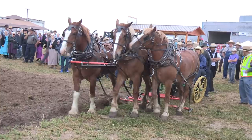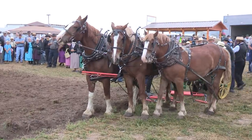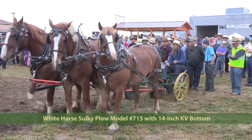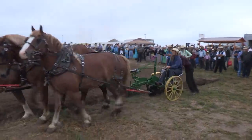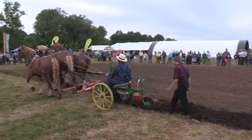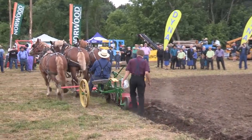Model 715 is an advanced plow with a combination of unique features, designed for tough, rocky conditions. Spring assist easy lift is connected to both wheels and will lift the plow evenly. Hands-free steering allows the rear wheel to catch caster when turning and locks it rigid when plowing. The drift hitch can be adjusted horizontally with a hand lever without stopping the plow. Optional weights can be added for hard, rocky conditions, allowing the plow to remain stable with leaf springs fully activated.